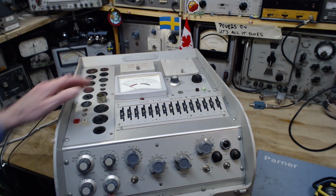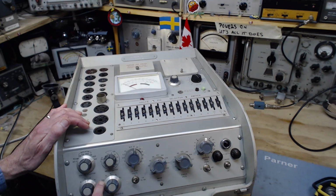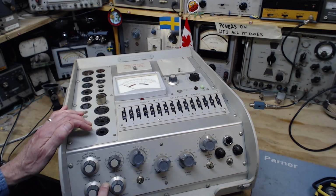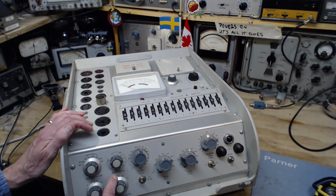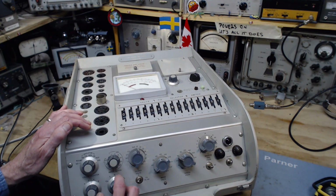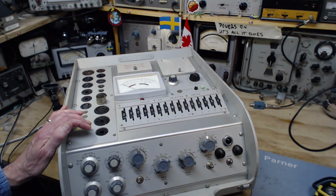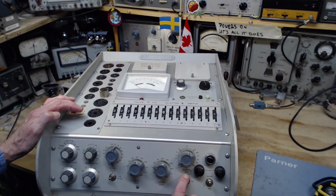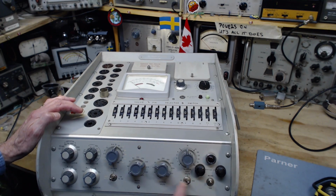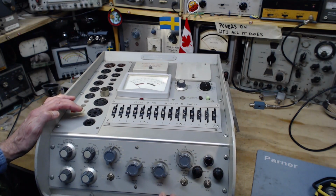Maybe this is attaching the meter to a particular electrode so you can read the, because what have we got? We got CH, that would be a cathode or a heater. Okay, I got that figured out. And we've got A1, A2, anode, and D1, D2, diode. I don't know what. Negative grid volts. Again, it's calibrated right in volts. There's a switch here, ×1 or ×2, so that'd be like -5 grid volts there.